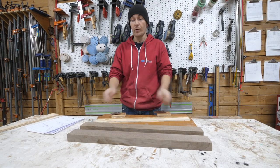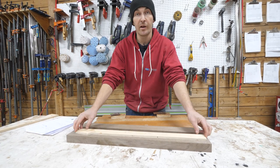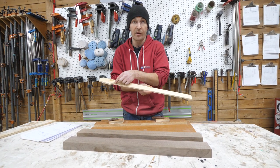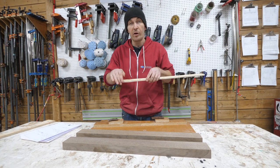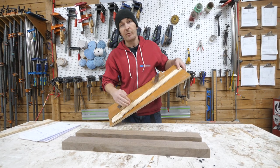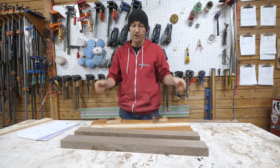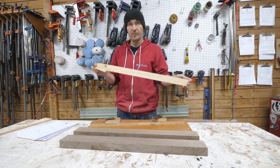So next up, we're going to work on the bottom rail. Here's the template. We're going to trace this on our leg blank. And then at the table saw, we're able to cut in here at 1 5/8 from the fence and stop just before the curve, go to the bandsaw, finish that curve off. Then where this joint location is, we're going to use another jig, get it mounted on there, and at the table saw, we're going to cut that nice and square and exactly where we want it. So let's head over to the bandsaw and the table saw and get the two bottom rails fabricated. Let's go.